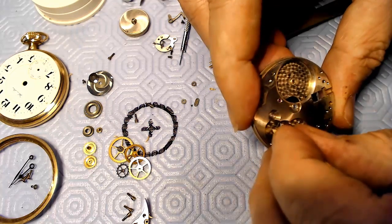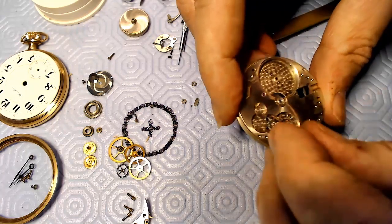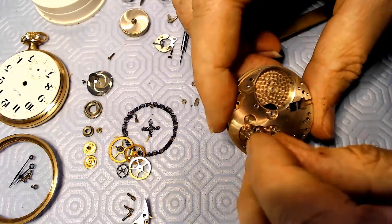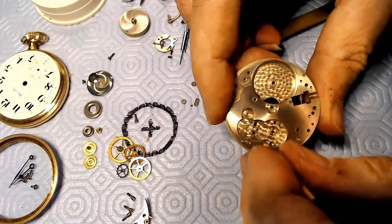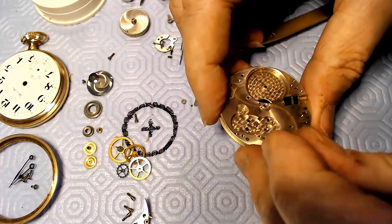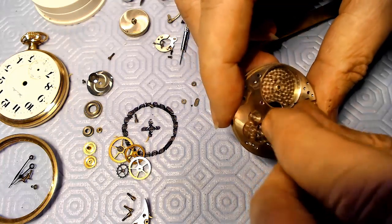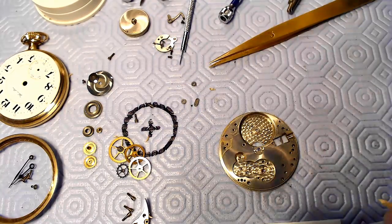And this pegwood just sort of forms to the hole. It's not a hardwood, but it's soft enough to be able to go in and turn that and then clean it. And I look to see if I snap the end of the pegwood off as well, because I don't want to do that. That would be nasty. So that's this side all pegwooded, and I'll do the other plates, and then I'll take off the upper and lower caps for the jewel.